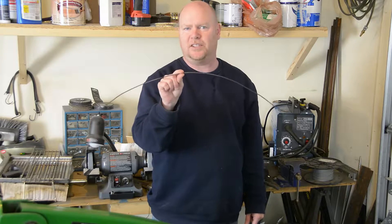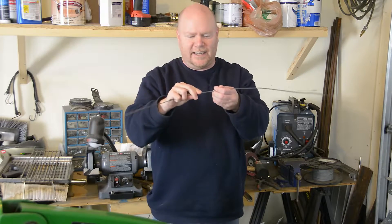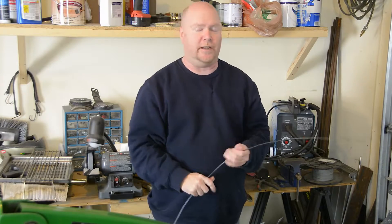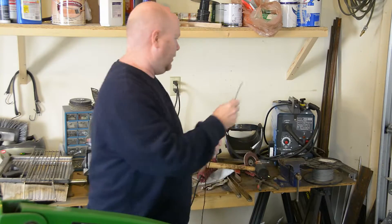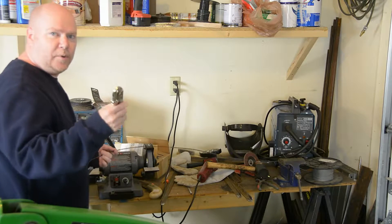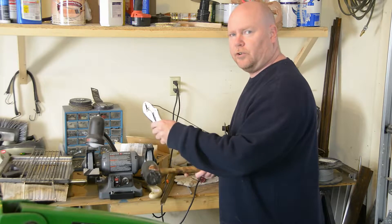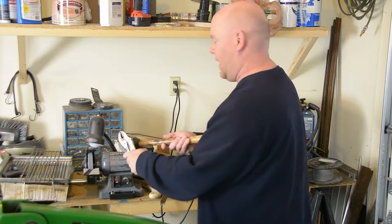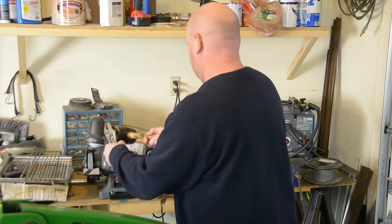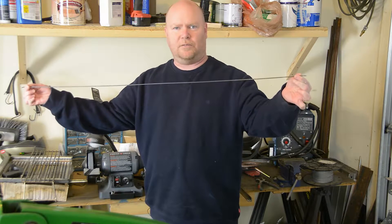One complication is that these elements do need to be straight. Just sitting here and bending the copper out by hand kind of takes forever and it doesn't actually end up straight. There's a trick you can use: snug one end of the wire nice and tight in your vise, and on the other end get a pair of channel locks or vise grips. Make sure you've got a really good grip, then give the vise grips a whack with a hammer. You're stretching the copper, so don't overdo it because you'll make it brittle — but it comes out perfectly straight.